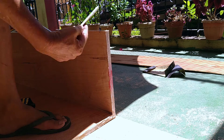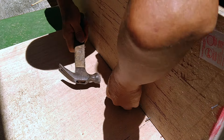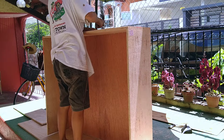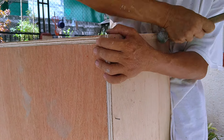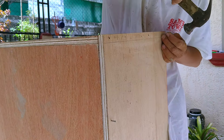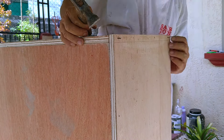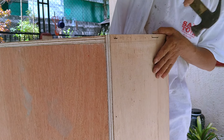For this project, I collaborated with my friend Marshall to bring my vision and design features into reality. The first design feature was strength and stability, so we used three-quarter inch thick marine plywood as our raw material to form the structure, and fastened the carefully measured and cut pieces together with a combination of wood glue and one-and-a-half inch finishing nails. Here's a pro tip Marshall reminded me of: until you are already sure, never hammer your nails all the way into the wood, so it's easy to pry them out and make micro adjustments. Once everything is squared and flush, that's the time you drive the nails all the way through.